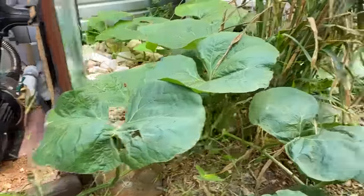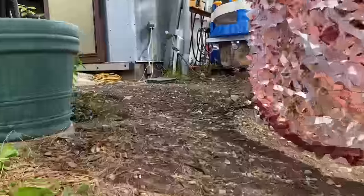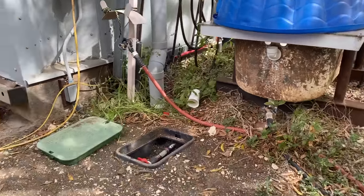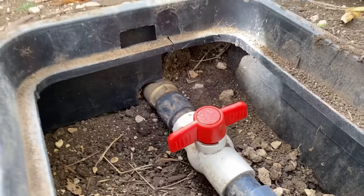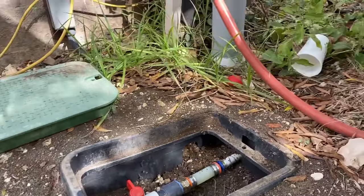At this point, the water goes underground and runs through the same trench that the gutter pipes were buried in. The water pipe then joins with a spigot pipe just outside my workshop. Since this pipe connects to the house plumbing, the water basically enters my house from here. We placed a backflow preventer here to prevent city water from accidentally flowing into my tank in the event that I ever turn on the city water up at the street.